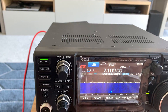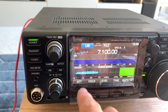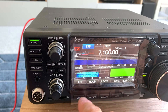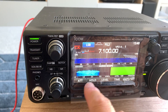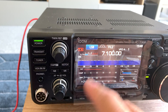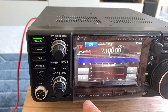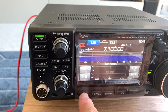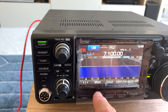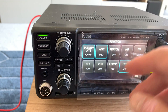If you hit the menu button here, you get options for scope and audio — though I'm too far zoomed in on the bandwidth on the scope to actually see any audio right now. There are options for whichever meter you want to look at: ALC, comp, SWR — it actually produces a standing wave ratio graph as well. Then there's a function menu: preamp, attenuator, AGC, automatic gain control, notch filter, noise blanker, and noise reduction.